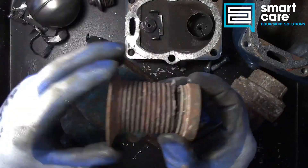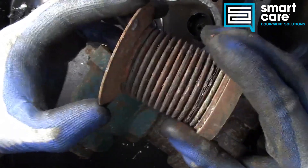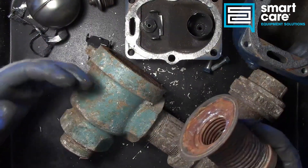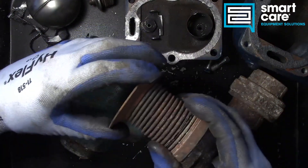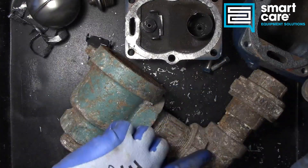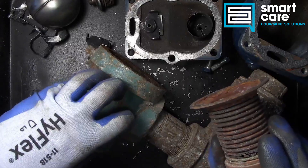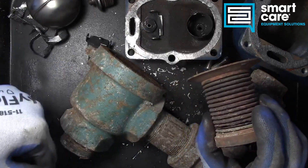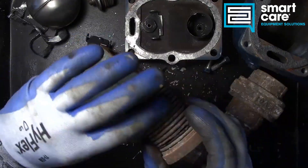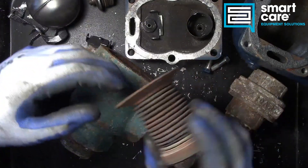In this particular case the bellows completely came apart. This is from a steam heat system — not a cooking appliance — but it's a very similar setup in that we're using that thermostatic element to open and close a valve. The condensate would flow down here and the valve would hold until the condensate cooled it, then lift to let the condensate flow through. As the steam came in behind the condensate and reached the bellows, the bellows would expand again and seal the valve back up. Just a very simple system.